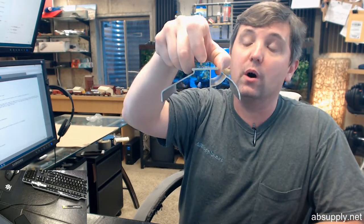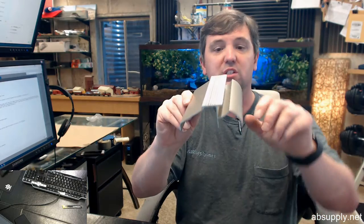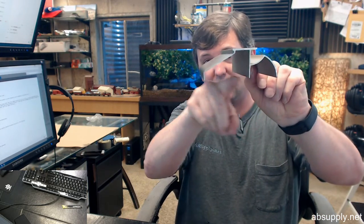And that's standard design for interlocking thresholds. Generally it is, especially when it's tall. You could do an interlock that's 5/8 tall and it wouldn't have a trough because it's not tall enough. You'll notice that you have to select either water pan required or no water pan required. A water pan is made of either aluminum or brass. It's just sheet metal, really, and it's nothing other than a piece of sheet metal that would sit down here to act as a barrier to any moisture that did get in.